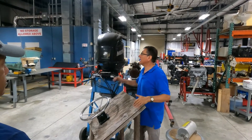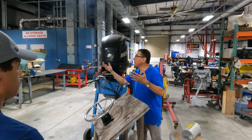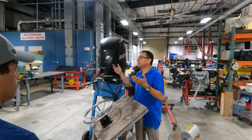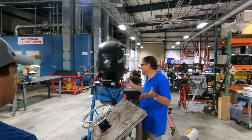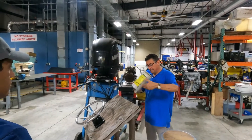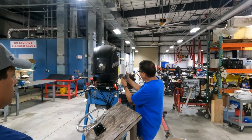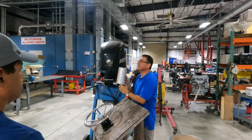I love a hydraulic circuit where I can check the level, the color, the bubbles — it's easy for me to administrate my hydraulic system. This system is working, but it's completely closed. So I am going to cut the lines and insert in series this element.